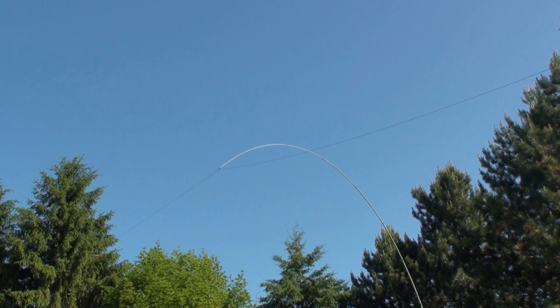I mentioned that for my Field Day deployment, the antenna was erected in a compromised manner. Due to space constraints at the campsite, I had to install the antenna as an inverted V with the apex at about 30 feet. There was an angle of about 90 degrees at the V. According to Ron at the high-end company, for best results the antenna should be deployed not as an inverted V, but in a straight line, either as a sloper or in a horizontal configuration. If you really need to install the antenna as an inverted V, the preferred apex angle should be no less than 120 degrees.